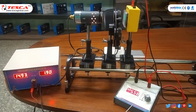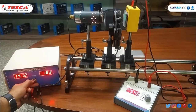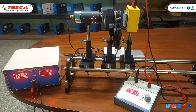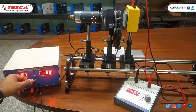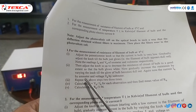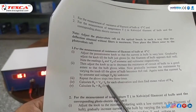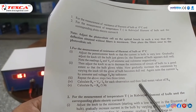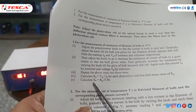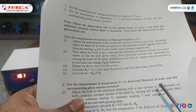We will then gradually decrease the current and voltage in steps of 1 or 2 volts, noting down all three values each time, and continuously repeating this step until we again reach just-glow or dull red condition of the filament. Repeating the above steps 2 to 3 times, we calculate RG = VG / IG — the resistance for each observation — then find the mean value of RG. Finally we calculate R0 = RG / 3.96. The complete explanation and derivation are provided in the manual.